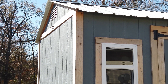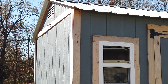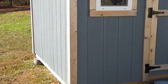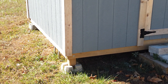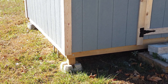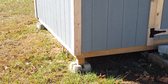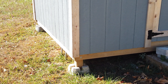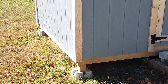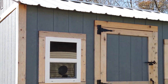It is an 8 by 10 building. My backyard is not level, so I had to build the building on piers. Each corner and two in the middle are on concrete bolsters, and under each of those there is a concrete pier that goes down about two feet in the ground. It's sitting on concrete, which gives me the ability to level things out a little bit better. Metal roof — I made it white so it reflects the heat a little bit better.